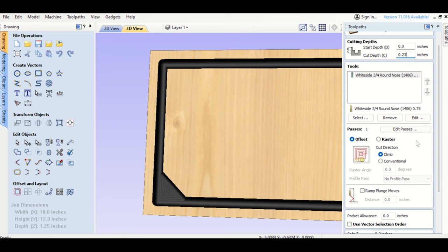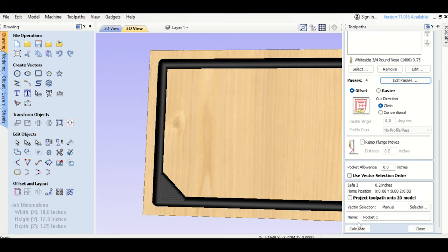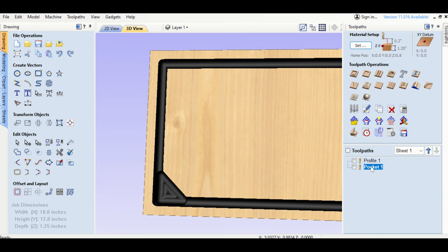That's it — creating a pocket is that simple to get a well done. Save it, good to go. Now for fluting: how I got it to angle down. I made the well deeper — instead of 25 hundredths, I went to 45 hundredths of an inch, almost half an inch. I set four passes so it goes much deeper. There are ridges that can happen when step-over is set wider, so doing a finishing pass is helpful.